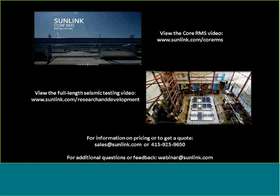That's great, Jeff. Thanks. I've got a question here about Precision specifically and how it's ballasted. Although we didn't show a slide detailing the ballast solution for Precision, it is what we call a ballast basket. It's different than the Core ballast pan in that it actually looks like a wire-form basket which attaches to the long beam assembly and holds standard-sized pavers. As I mentioned before, it also holds a rubber pad to keep both the pavers and the metal or wire form ballast basket off of the roof. But you can go on to our website to get further details on that.